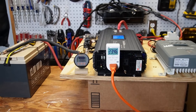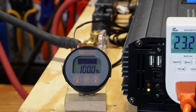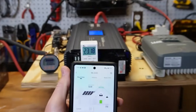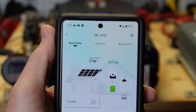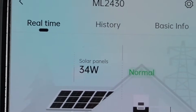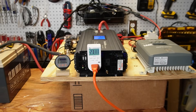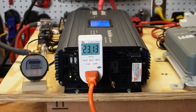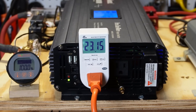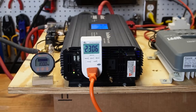Here we are inside. The freezer is currently running, drawing 23 watts out of the inverter. The battery is full, so the solar panel and charge controller is keeping everything full. On the mobile app for the solar charge controller, it's bringing in 34 to 35 watts on average. The reason that number is low, even though we're getting really good sun on the panel, is because the battery is full and the freezer is only drawing 23 watts. It's bringing in about 35 watts, which is 12 watts more than what the freezer is using, and the inverter is using those extra 12 watts.